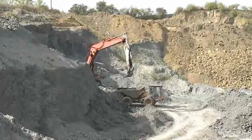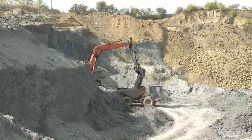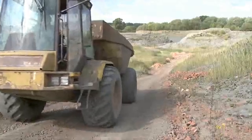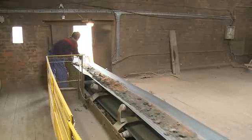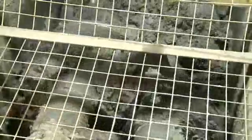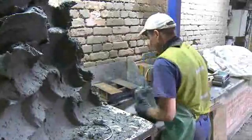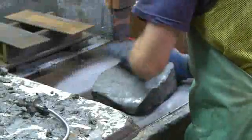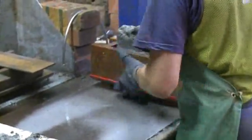Each handmade wire cut brick starts here, getting a blend of the two clays to create the right hardness and frost protection. A short trip to the conveyor belt where it's hand sorted, then through the mill where it's ground to a fine texture. Large pieces of clay are grogged — previously fired clay ground up is added to reduce shrinkage — and then hand thrown in the centuries old way by master brick workers.